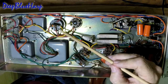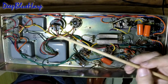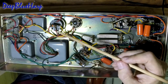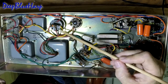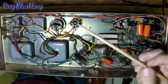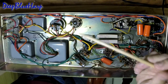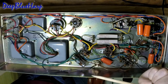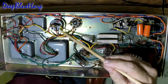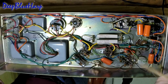The reason I said check it within the hour is that when a capacitor of this size is left alone, enough static charge is picked up and it will re-energize. Just a few volts isn't the problem, but a few volts and just a tiny bit of residual current in this can capacitor - and if you put your fingers across the lugs, it will set you back. That is very dangerous. So we take it out, check it, safe it off, generally ground it out, put it back in the circuit if it's good. So that's what I'm going to do to check this unit out. Hopefully this is the shorting capacitor, and if not, then we'll go to plan B and check that.